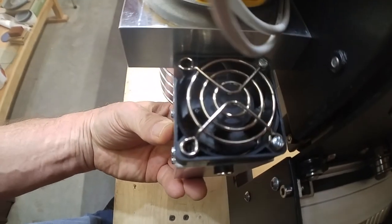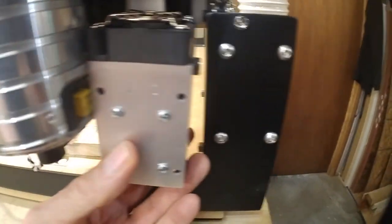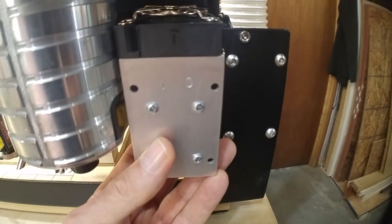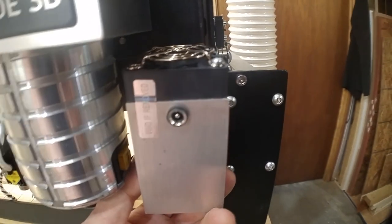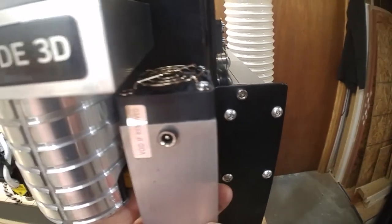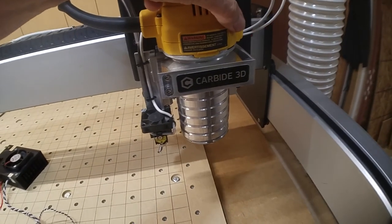But there's not sufficient room because of the size. I don't have the clearance on the right side to mount this. If I mounted the laser directly onto the spindle with no clearance, orienting it so the power comes out the side, I'd risk the Y axis bringing it all the way forward and running the laser into that plate. So my plan is to mount the laser to the very front of the unit.